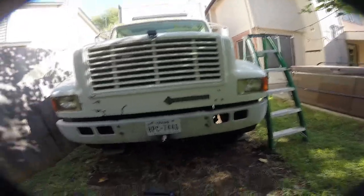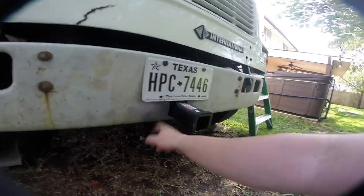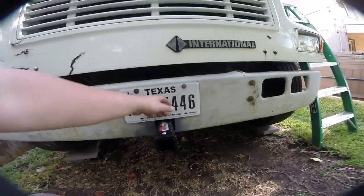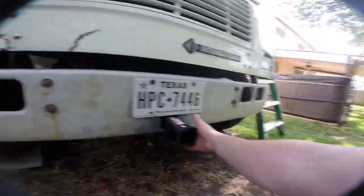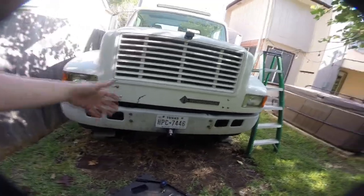Here's the finished product. Basically, we took our receiver tube and bolted it in. Then I plasma cut out a 3x3 inch square, a little gray spray paint to make sure things don't rust, bolted this all back in with the bumper back in. Used some riv nuts to move the license plate up about half an inch so that it clears the receiver tube. We've got our receiver pin hole right here — we've got our receiver. The beauty of this is we can put a motorcycle rack on the front, a little barbecue grill, or just a storage tray. The possibilities of what you can put on the front of this thing are endless. Plus it gives us another recovery point — I'm going to get a big old D-ring that will live in there full time.